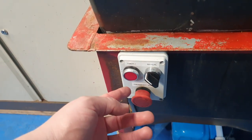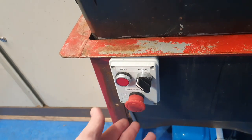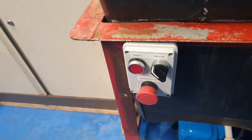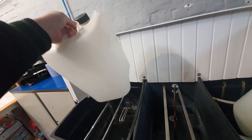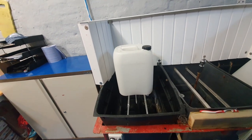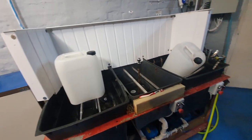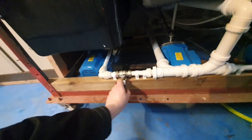On the controller you've got an on/off switch for the timer, a manual switch if you want to override and run it as long as you want, and also an isolation plunger — so when power comes on, if there's time left on the timer it doesn't accidentally spray you in the face. Just in case it does, we have these jerry cans from old batches of chemicals with the bottoms chopped off — we just sit one on top to prevent any accidents. Works fine.